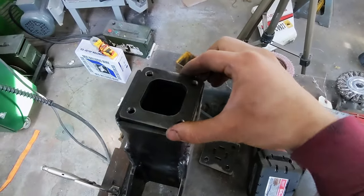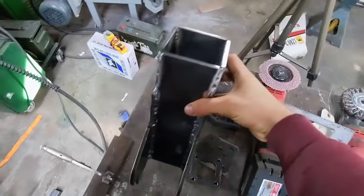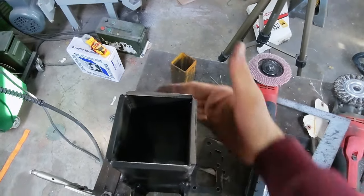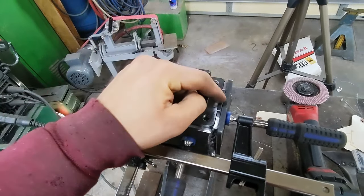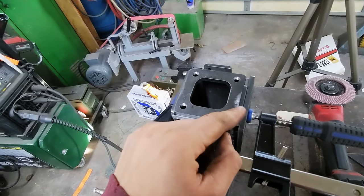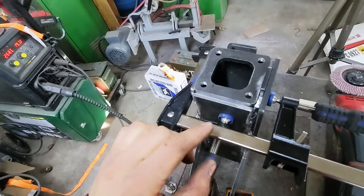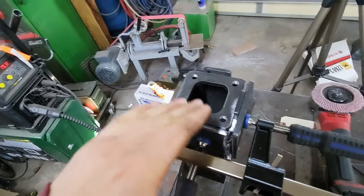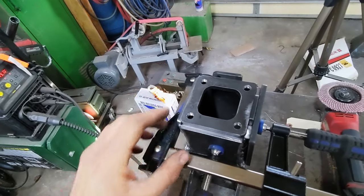Now I need to weld this mounting flange square onto the back of the main part of the vise. I've got to grind this all until it's as square as possible to the rest of the vise. Then we can clamp straight edges to the sides and put three-sixteenths shims in between to center this up. I'll probably change this to eighth inch shims in the plans because only having a sixteenth of an inch on the sides makes it kind of hard to get squared up. Also, if you're cutting these parts out with a plasma, make sure you keep the bevel in the same direction — toward or away from the middle of the hole — on all four parts; it makes squaring up a lot easier.